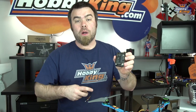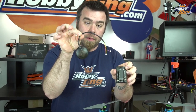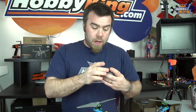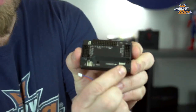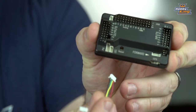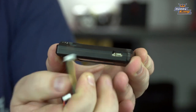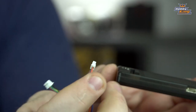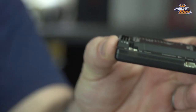You have your APM board, of course, and you're going to plug those different accessories that I described into it, that being the compass, the power module, and this cable that is the communication cable for the two-way radios. Now, for the most part, the things are pretty clearly marked here on the board. You've got GPS labeled there. That's for the main GPS connector. What's not so clearly labeled is that this little connector on the side is for the compass connector on your GPS. That's what that other little pair of pins is. So that's GPS, that's compass, GPS, compass, right?